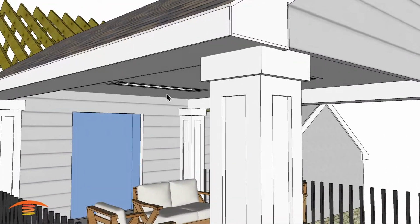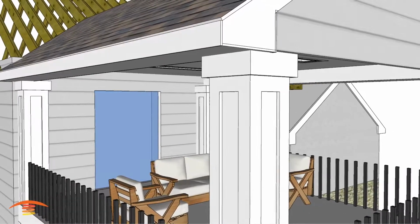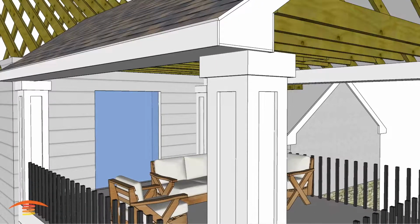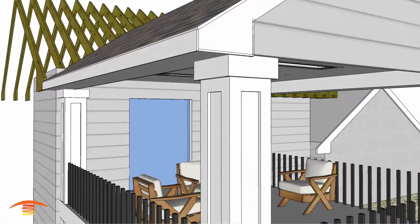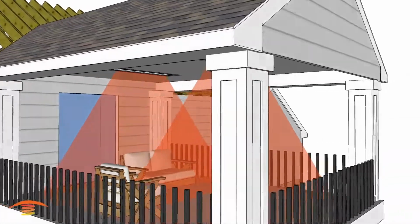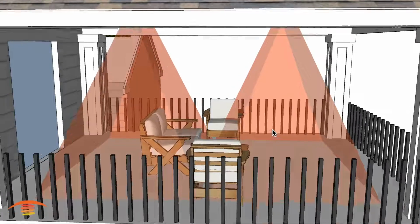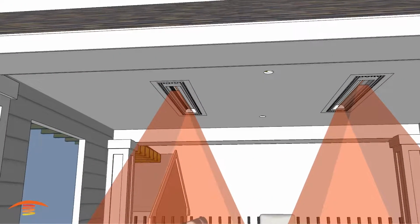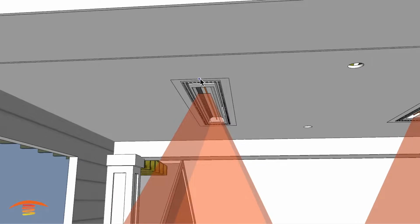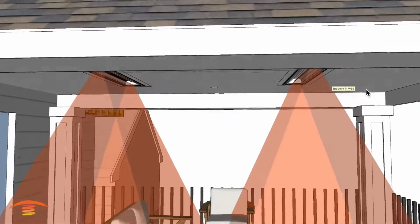These are again 4,000 watt units, so they do require that total of 33.4 amps. And let's see here what the footprint of heat would look like. Overall footprint of heat, you'll see here, we'll cover this space fairly well. I do have them, I believe, at 6 foot apart. Let me just double check that here. And 7 foot apart.